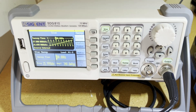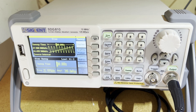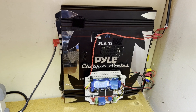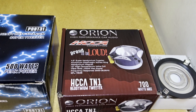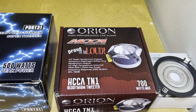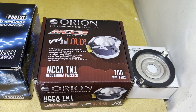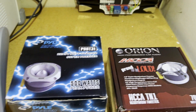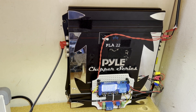The arbitrary waveform generator puts out a constant sine wave into the tweeters, and especially in an amplified application it'll heat the voice coils up really quickly. I smoked that Orion running around 40 watts in less than 10 minutes. I was able to replace the voice coil for $30 so it's all back up and running. Right now it's set for about 15 watts and I don't seem to have any problems yet.